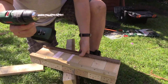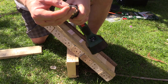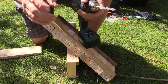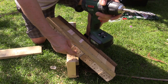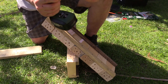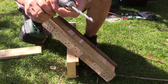I've seen a few YouTube videos where, when you're drilling out the wood, you get a proper wood drill like that, which brings out the sawdust. Otherwise, in loads of YouTube videos they're using steel and plastic drills, and you can see the wood smoking as they go in, because it's just heating the wood up. What you want is a proper pointed wood drill. You see the twist on it, it brings all the wood and sawdust up, and it's much more efficient.